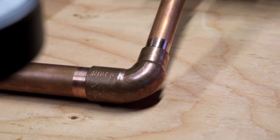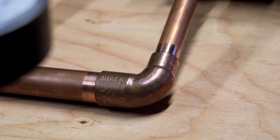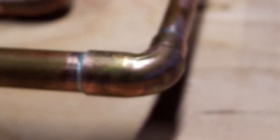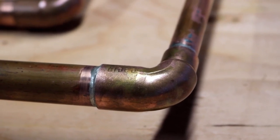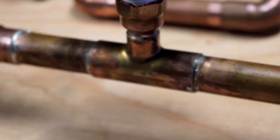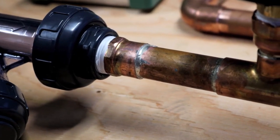I've already dry fit all these pipes together — I measured, cut the pipes, and test fit them. Frankly all that took quite a bit of time, especially since I've really never done this sort of thing before. I did practice sweating a couple of pipes, and now I'm starting to actually sweat the pipes for the project. You can see the solder on the left side of that elbow — they're not all that pretty, but it looks like they'll be solid at least, and I'll hopefully get better as I go.